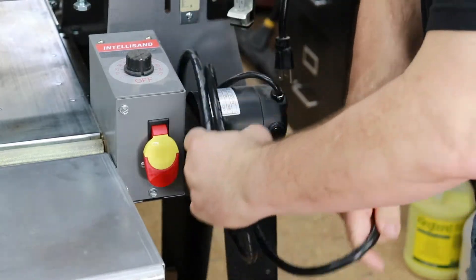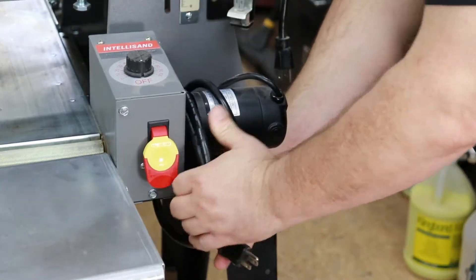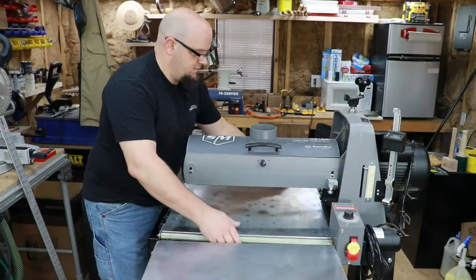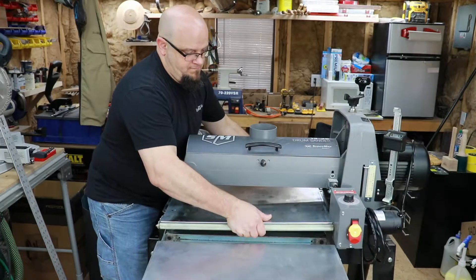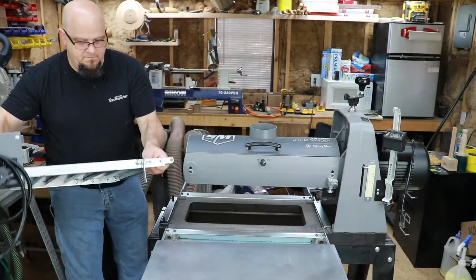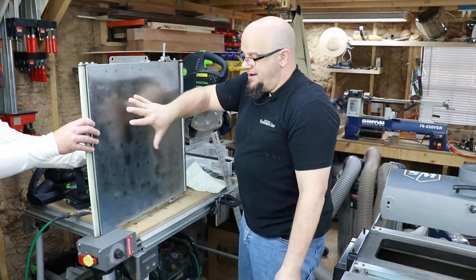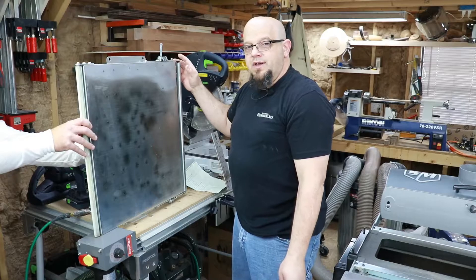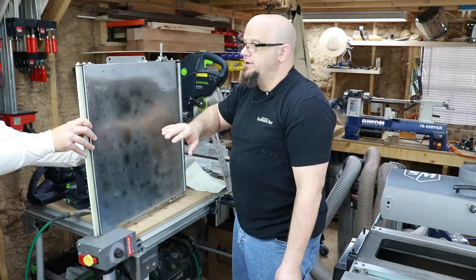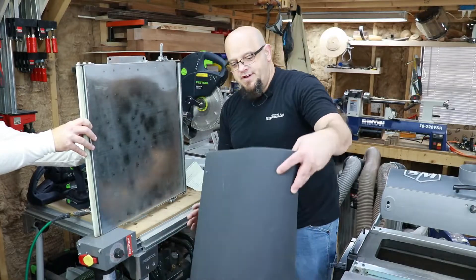To make things a little bit easier, wrap the power cord around the drive motor, carefully lift up and remove the conveyor belt motor assembly. These are kind of bulky and odd to work with, so either figure out a way to clamp it laying down and start the belt, or have a buddy holding one end while you get it started.